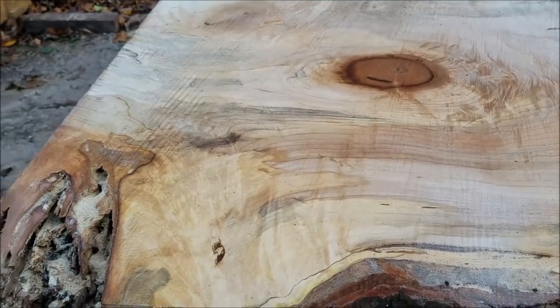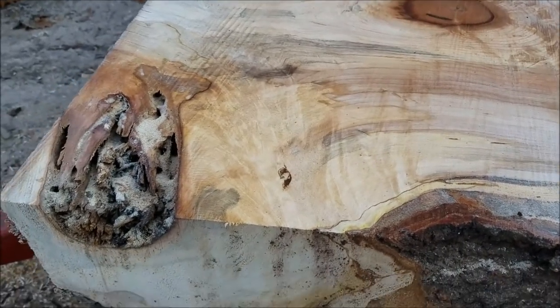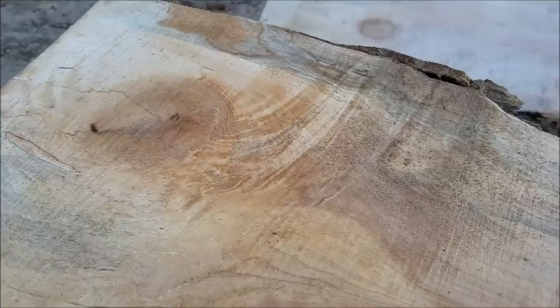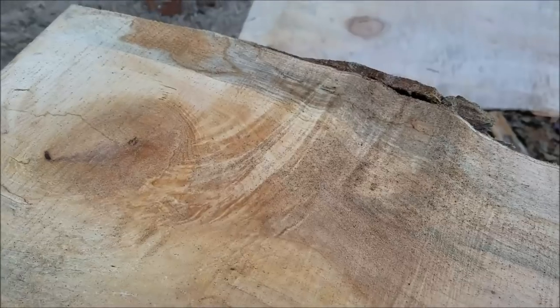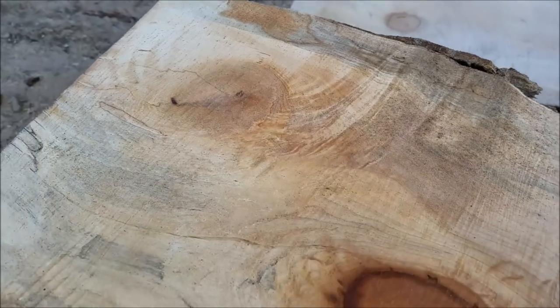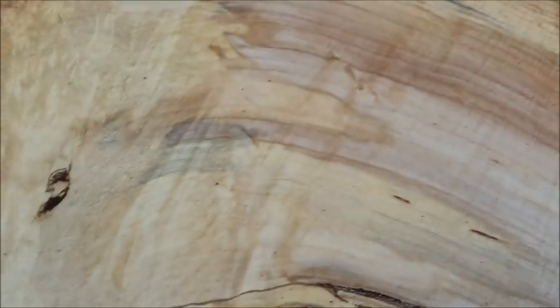We're not dumping water this morning. At 22 degrees, I don't need to be icing my mill over, so we're not going to be dumping water on the mill or the logs today. Instead, maybe on the really interesting parts. As you can see, we've got this one already trimmed and ready for slabbing. We'll spray up the interesting parts with a little misting spray here. That'll bring out enough detail without soaking the whole mill down.